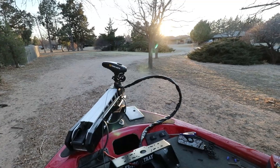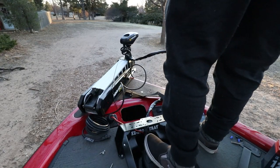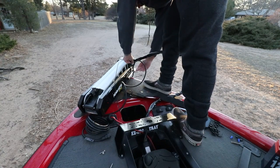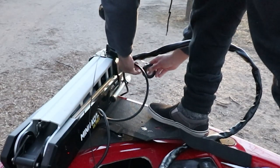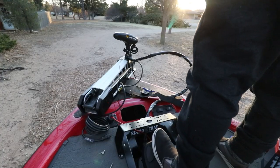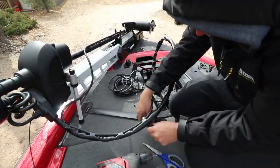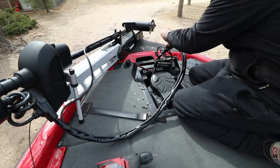I'm going to step on the trolling motor, spin it all the way around, and make sure we have enough slack — careful not to hit the transducer on the trailer. It's all the way twisted — I'm going to lock it in place with one piece of tape, then spin it all the way around the other direction and make sure it's still loose enough. It is the next day — let's go ahead and finish this install. We need to continue wrapping this wire to this wire.